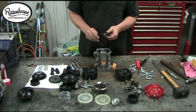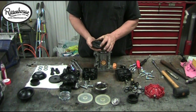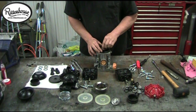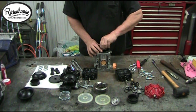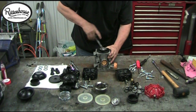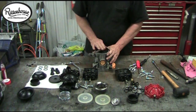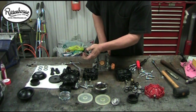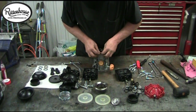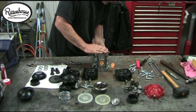Replace the diaphragms — they're marked. Some are marked 'oil side' and some are marked 'liquid'; on these ones they're only marked 'oil', so that side goes in. When tightening up the bolt for the return washer to hold the diaphragm in place, just take it so that it's snug, put your hand on it, and give it a tap — that will end up in about a quarter of a turn. Push the diaphragm in so it sits all the way around in the groove before you put the head back on — that way you know you've got a perfect fit.